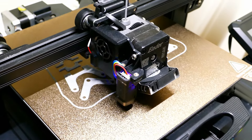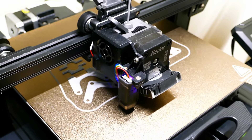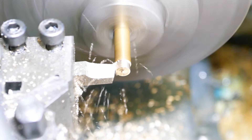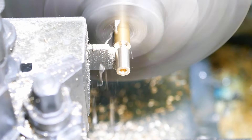In order to do a test assembly of the gearbox and test all the components, I'm making a temporary rig using my 3D printer. Eventually the gearbox will have a proper metal case but this is an interim step so I can get everything running properly. The selector bars fit into little brass bushes so I need to machine these up quickly.